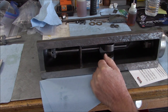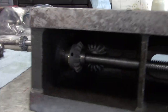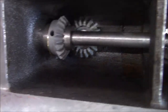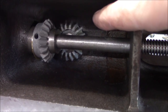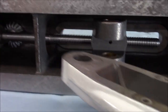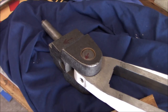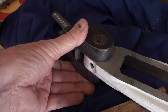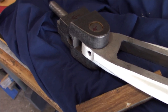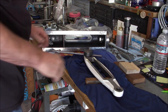You've got to line up the pin, spacer, washer, and be on the other side of that gear with the trunnion. On final assembly you've also got to have the lever arm in there — so this is going to be fun. My other thought was to double up on these set screws but there's just not enough thread depth to do that. I think this is the way to go; you could also use Loctite.